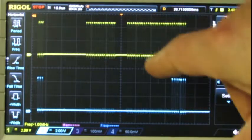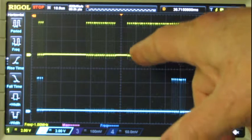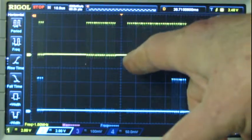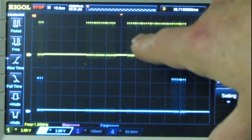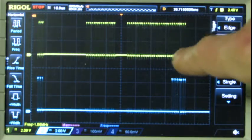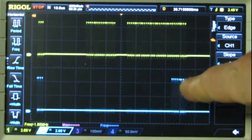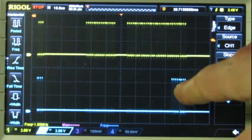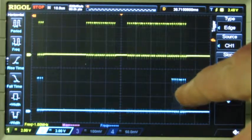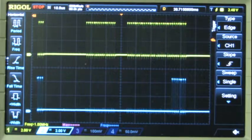Okay, here we place the delay, and it's about 8 microseconds, I think. We place it after the 16 bits, right after the end of the red, when it should start doing the blue. And we see it's caused a weird problem. The LEDs are kind of blinking. I'll show you those in a minute. But it also is chopped off. It's truncated when the bits that are on come out of the part. So it seems to only be doing the last 8 bits or so.